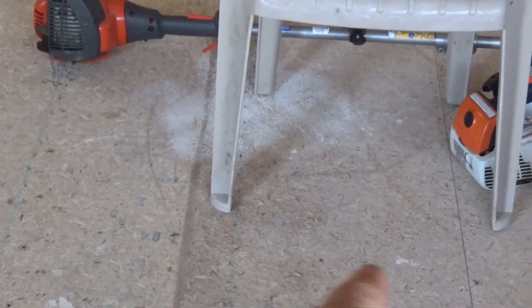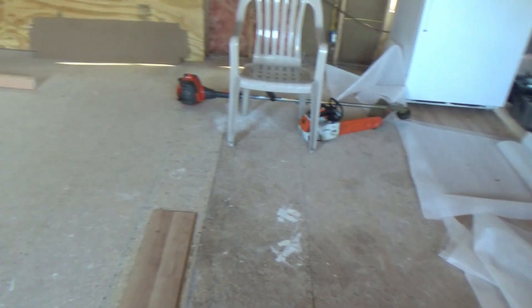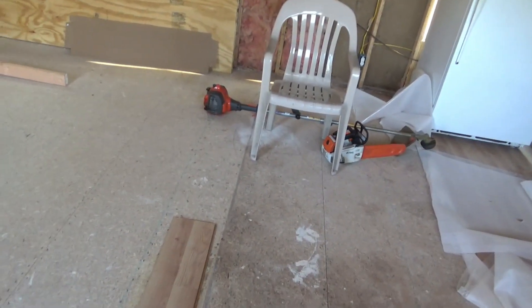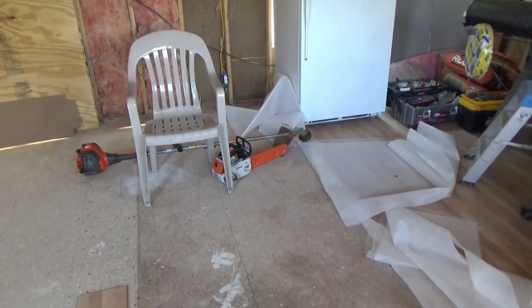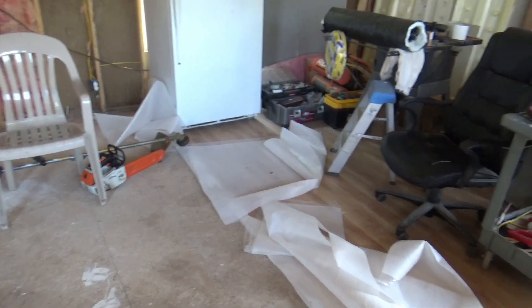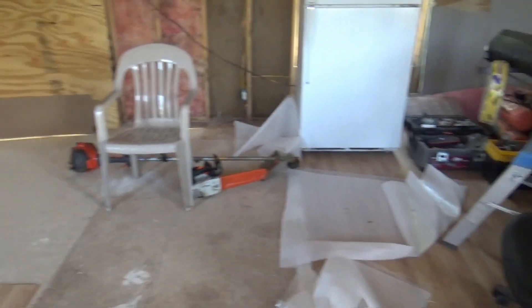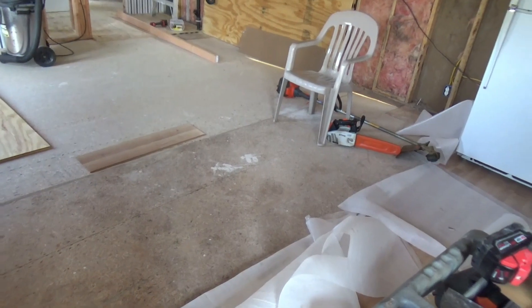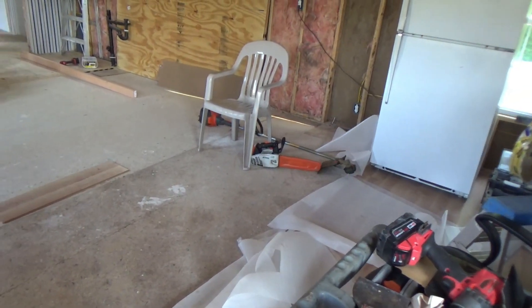Apparently there was carpet from that line over that held water for a long time and did some floor damage. When I peeled the flooring material up, they actually had a few pieces hidden underneath here because of some low spots. After checking around with the straight edge and levels, I'm finding I can fix some of this underneath the trailer just by redoing the leveling between the runners and the frame where they shimmed it up when they delivered it. Their idea of quality work is not the same as mine, so I'm going to redo that and it will probably fix a lot of the discrepancy in the leveling.